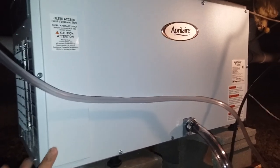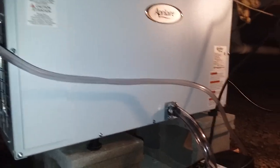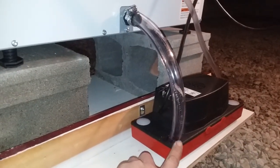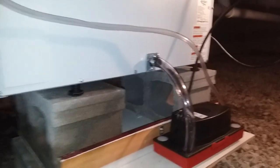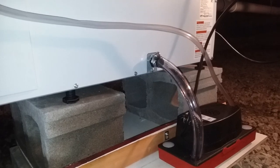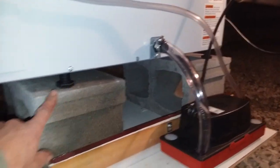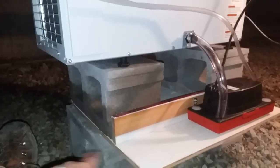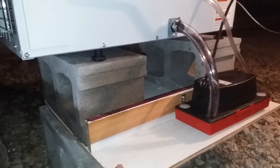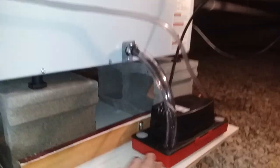It's a heavy unit, but wasn't too hard to install. Comes with 110V, 8-foot cord. We also bought the little pump. Me and my daughter installed it — my 13-year-old helped me install it tonight, so not too difficult for us to do. The only thing I had to buy was some hose to connect. I bought the cinder blocks, got four of them, leveled them off first, then put the plywood down. Here's a little bracket I made, another set for it to stand on, so that way the pump sits down lower.